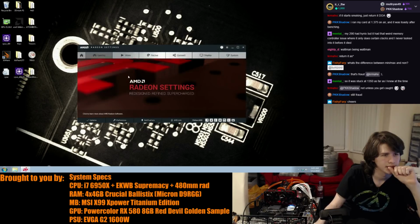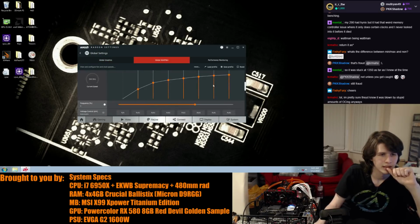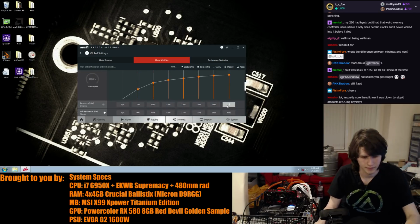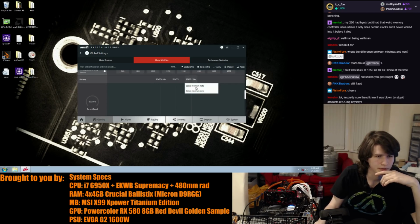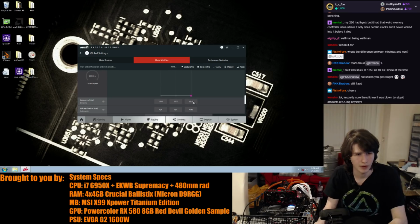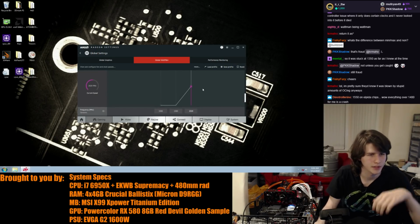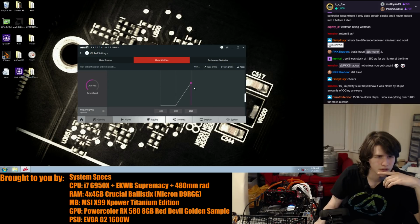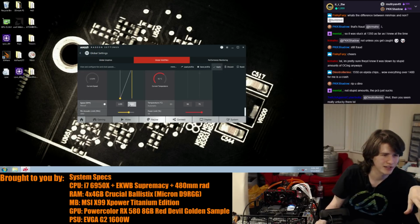Actually, I forgot to set that to performance. Anyway, let's set that. 1550. Set as minimum. Okay, so 2300 will absolutely not work. That is minimum. Now let's see if we can use 2000. Right. Okay, 2200 works. Okay, 2200 still looks like it will run. 2300 crashed last time immediately, so I'm not going to even try to run that, because I don't think it'll actually work.